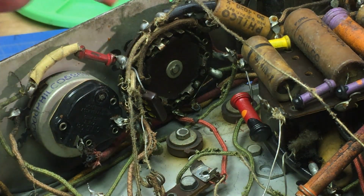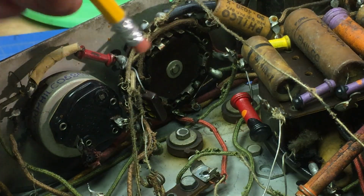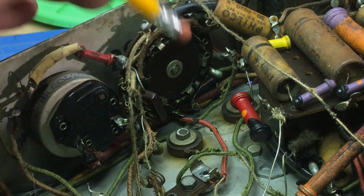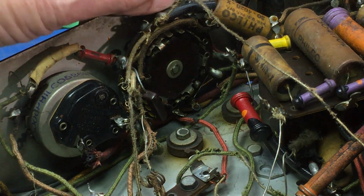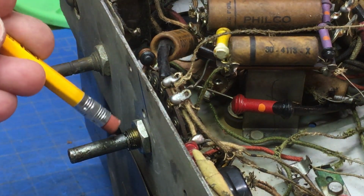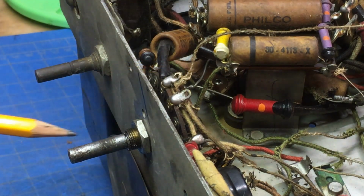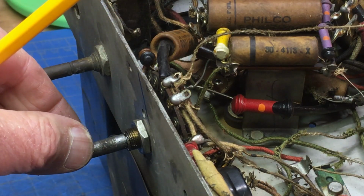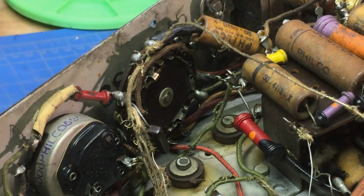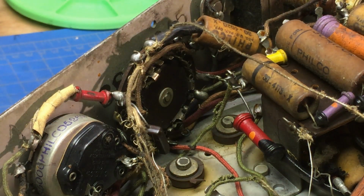It's probably cranking down on it made it fail, but why will it not stop? And there's either something broken, loose, or whatever. So we can see if we can repair that. Now, the thread on the forum said that there is this lock ring on this side. You take that off, and this is how you loosen the shaft and push it back through there. So that means that this center piece here should push backwards out, and then we can look and see.